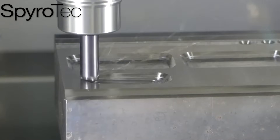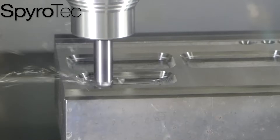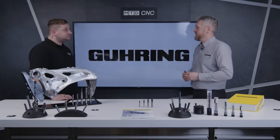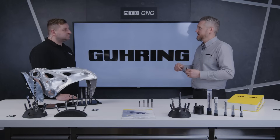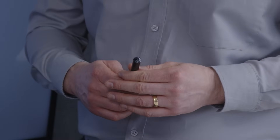It's a lot more versatile as well — you can go around the edge of the part and put a chamfer on, and you can pocket with it. So you're telling me I can chamfer with it but I can also pocket with it? Because it's all designed around a milling cutter, you can go into a solid piece of material and create a shallow pocket in there as well.